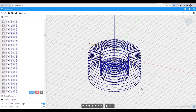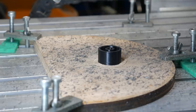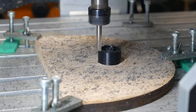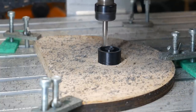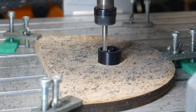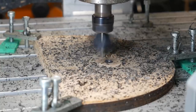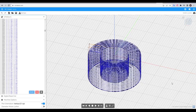So on to iteration 2. I used some Loctite on the retaining bolt, as well as applying more torque to secure it to the spoilboard. The gcode was updated to have the 1000mm per minute feed rate permanently added. Another change to speed up the job was changing the step down from 1mm to 2mm — and this proved a little too aggressive, the added force actually snapping the base of the 3D print, leading to a second spectacular failure. Therefore, iteration 3 restored the 1mm step down to avoid this calamity.